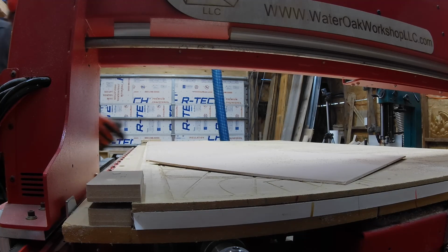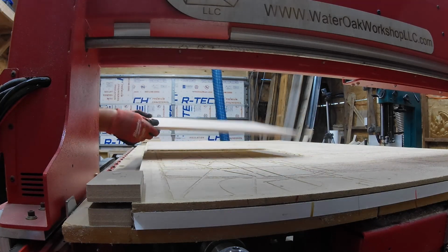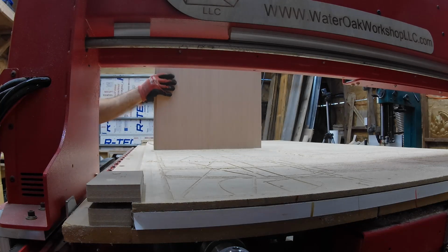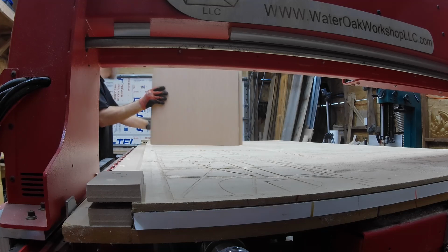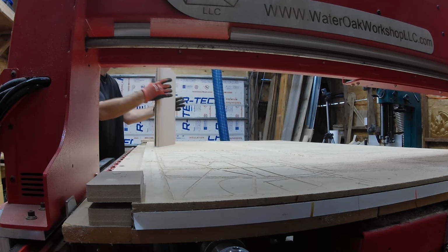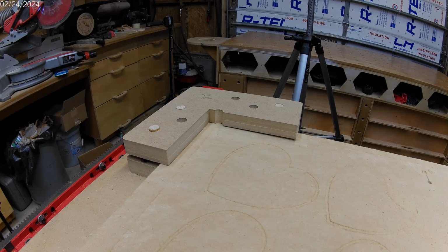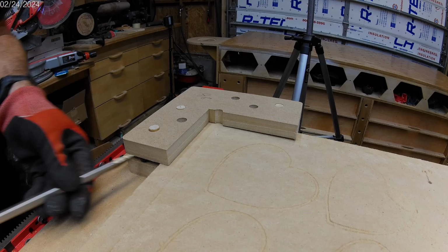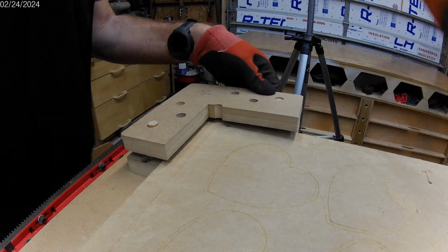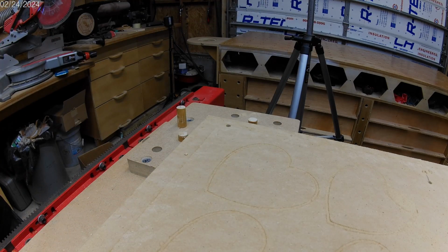As a note, sometimes when I get materials from Home Depot and Lowe's, it is not exactly 48 inches wide. In fact, sometimes it's 48 and an eighth inches wide. If you notice the stop blocks, they are marked because I have one set for 48 and another set for 48 and 1/8. The stop blocks are just friction fit on the half inch dowels and can be relatively easily removed. I like to keep the fit tight on the dowels because I like to keep things precise.